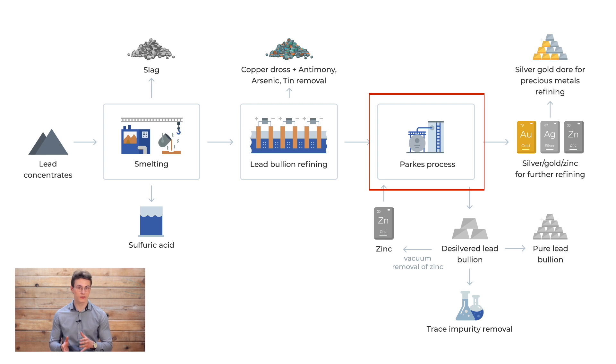The remaining lead-gold-silver residue is treated by cupellation, the process of heating to high temperatures under strongly oxidizing conditions for impurity removal. First, the antimony, arsenic, and zinc are oxidized and removed, followed by lead, with bismuth, copper, and tellurium being the last to be oxidized and removed as a slag known as copper litharge.